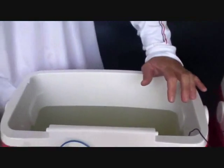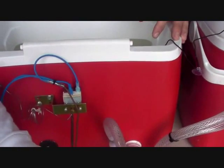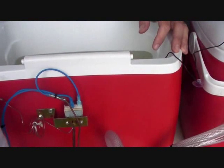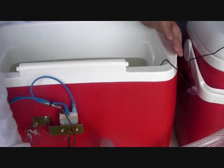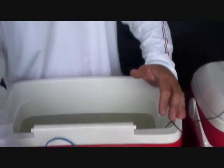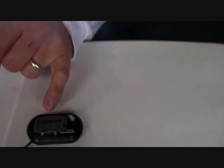To set this thermostat, if you put it on automatic, take your thermostat all the way counterclockwise. That's going to be set at 32 degrees, so it's going to run and run and run. You need to monitor your water temperature. We've already brought it down to 81.7, so we've dropped it 2 degrees already.